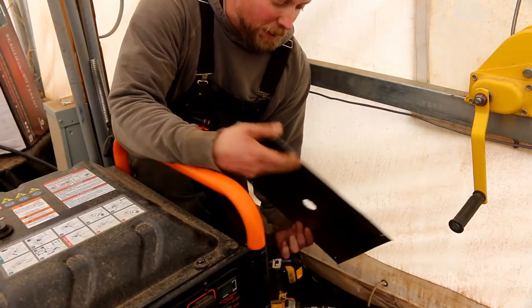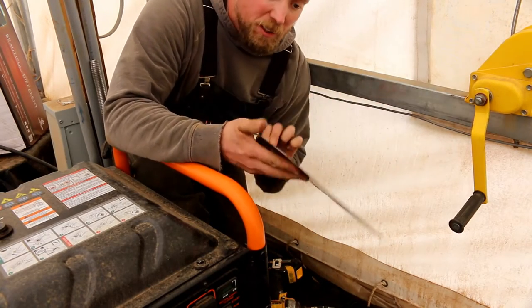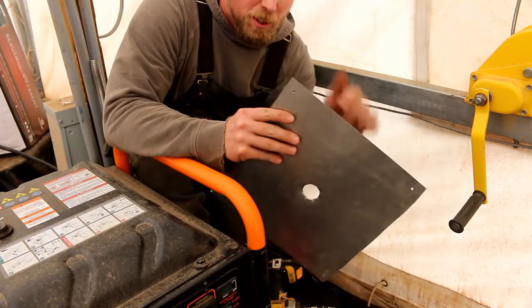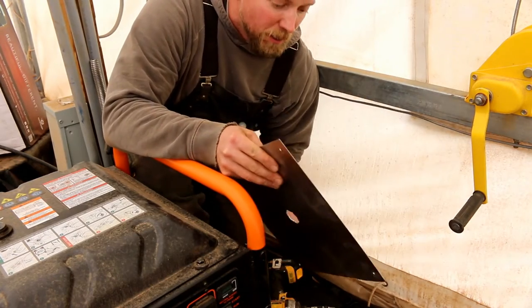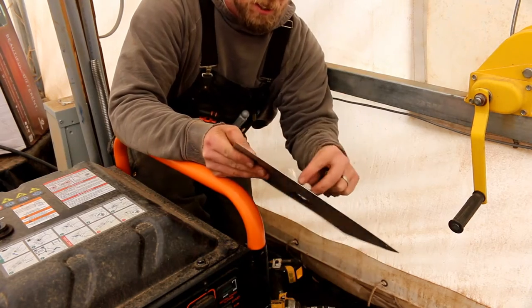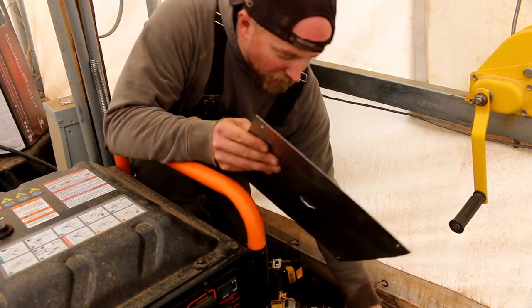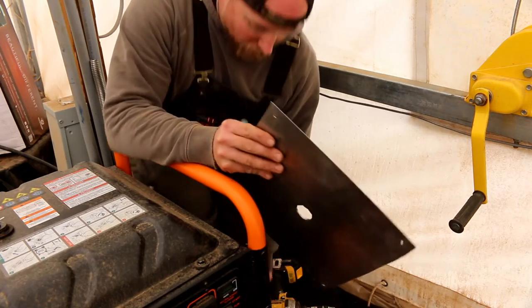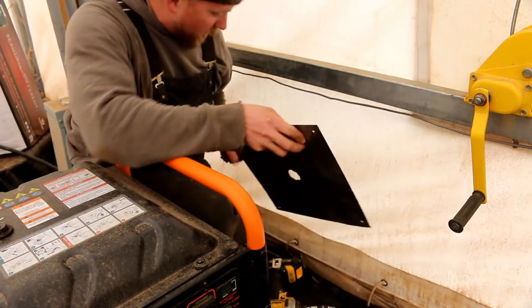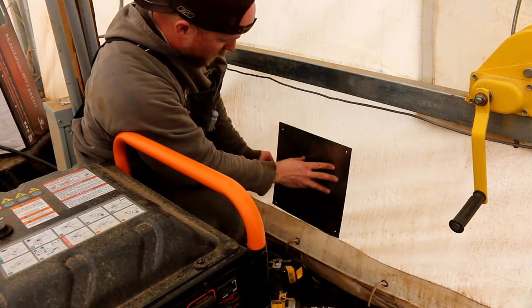All right, so here's my game plan. Here are these two pieces that I cut. This is one piece, the other piece goes on the outside. Screw holes through both, silicone around the inside of it, and then I'm going to stuff a little bit of stove insulation right around where the pipe is actually going to come through. We'll shove that in afterwards. Right now what I do is mark the building here where I need this to go through, right in there.